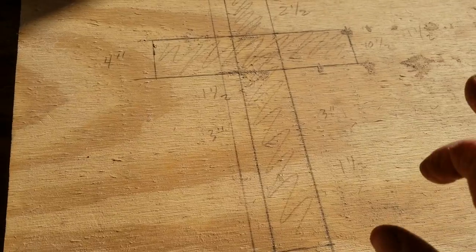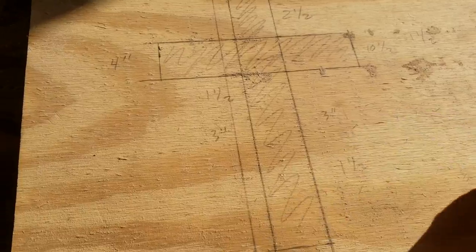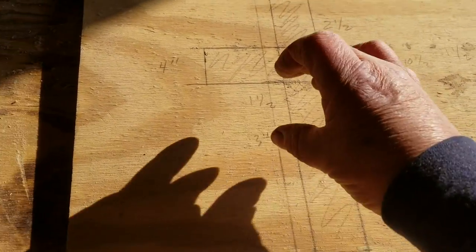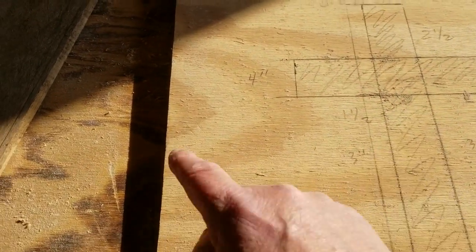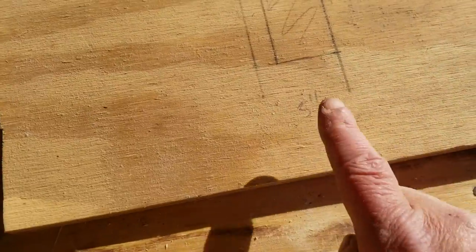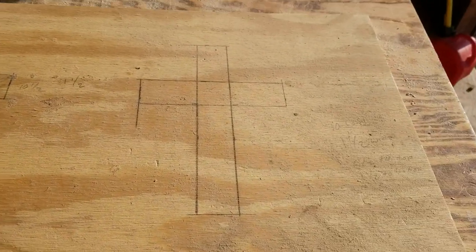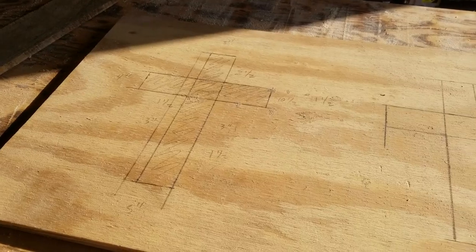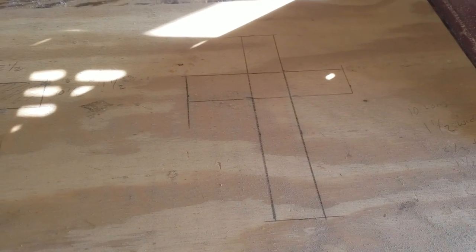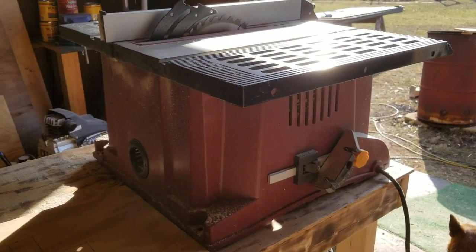What I like to do is rip a board down — maybe make one four inches and one two inches — put the two inch up here and the four inch down here, and on this side put the four inch up and the two inch down. The bottom is another three inches. The first thing I'm going to do is take my harbor freight table saw and rip the board down for the top and one for the bottom — these are three inches.